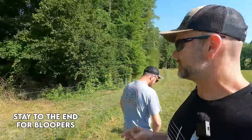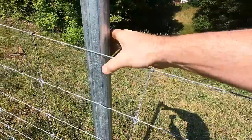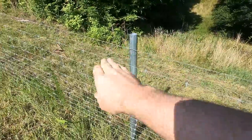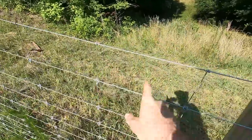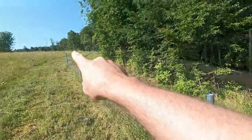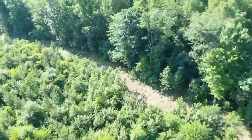Today, what we've got to do is tie fence wire off, and this is a 2-to-3-man procedure. Believe it or not, there are some very simple ties that tie these posts to this fence. This is woven wire fence, Titan 13, 48, 12, meaning we have 13 line wires going horizontally, 12 inch stay spacing in between here. And this is a fixed knot, called the Titan fixed knot. We're gonna be tying wire all the way up through as far as the eye can see, and as far as the eye can see down that way.